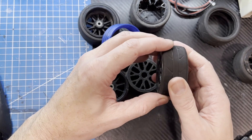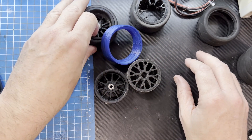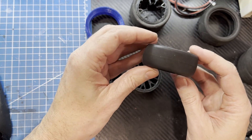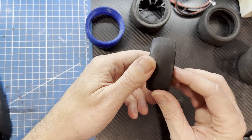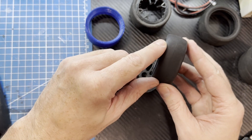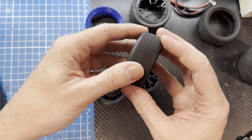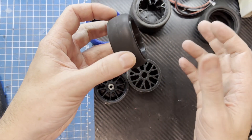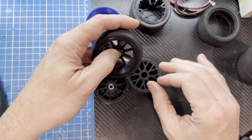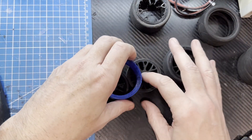At slow speeds the tires had no grip and were very unpredictable because they were so stiff. This time I bought a cheap set of slick tires from Amazon that feel stickier and have a much higher density foam — I wanted to try the foam since it's much lighter than TPU. But it immediately became apparent this foam still isn't stiff enough. We rolled the tires on both the inside and outside and destroyed the set very quickly, again capped at around 2.0 lateral g's. Luckily, Tamiya offers a Kevlar-belted tire for one-tenth scale touring cars with different densities of foam liners, but they've been completely out of stock everywhere I've tried to order them.